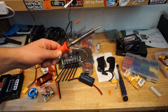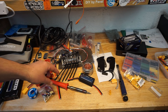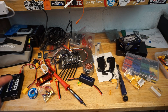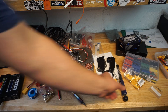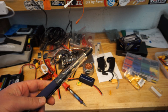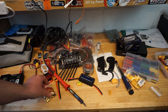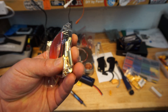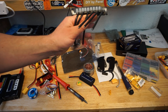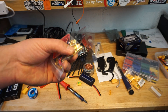Out of tools, obviously you will need a soldering iron. This one I'm using is 80W — anything smaller is going to be not that good, especially if you're working with XT90s and cables the size of 12 or 10 gauge. I'd also use a butane soldering iron once in a while — they're really nice for soldering the straight gold banana or bullet connectors. These are required to connect the VESC to the motors, and I'll show you the best and easiest way to solder them in my future videos.